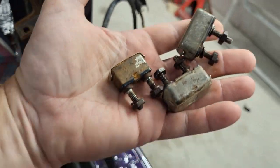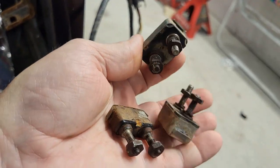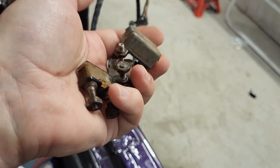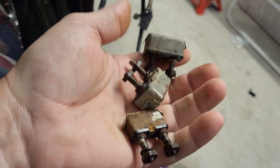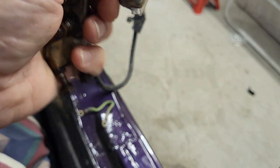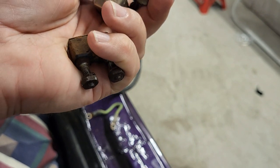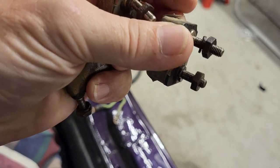Okay, guys, so getting ready to put the breakers in there, and I've got the old ones all out. Cleaned them up a little bit, best you can. But I've tested them, and they all tested good. So that's good. I do have some extras, but they're not the right amperage. Now that I have my electrical book, I know exactly what amperages these are, because they're not on here anywhere. I've looked these over, and I have no idea.